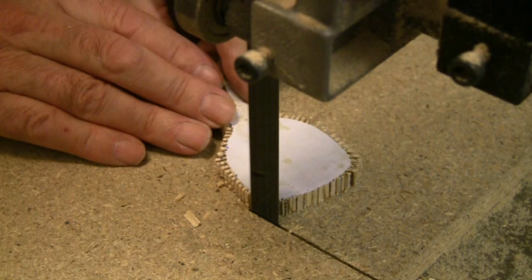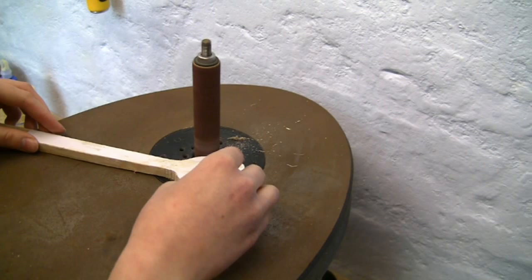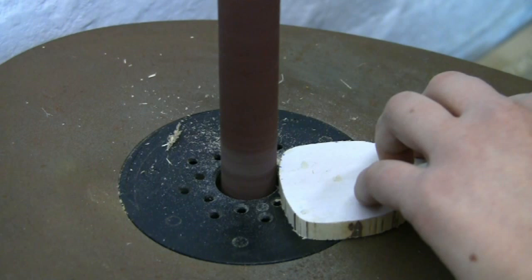This of course isn't the final finish. The disc sander attachment to an electric drill is useful for the concaves. In my workshop I have an inexpensive bobbin sander — a somewhat underrated machine for what it can achieve.